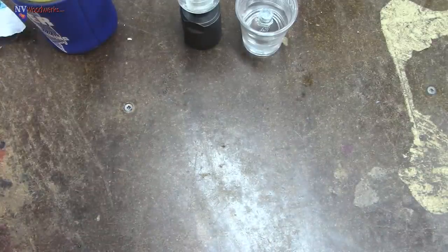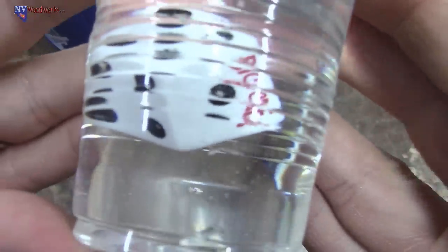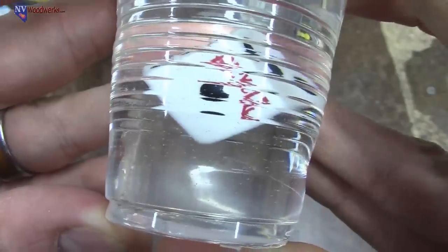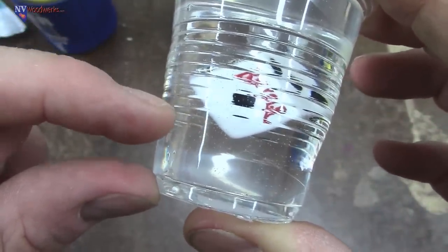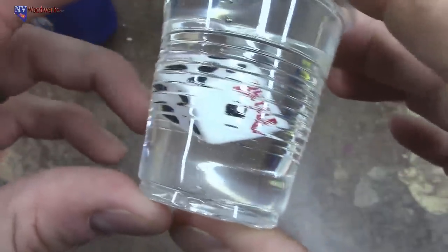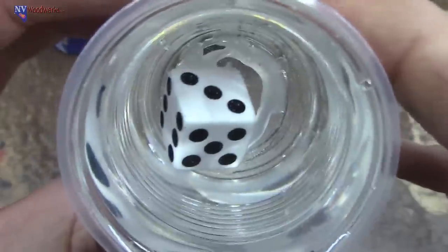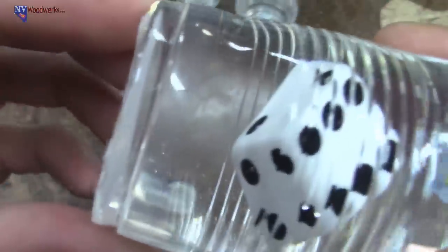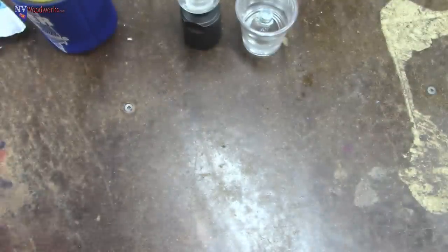Now this compares to the one that we did. I had to scrap the bolt, it just didn't work. But this one actually has bubbles. Part of the reason might have been because I waited a little too long to pour in the first layer. I mixed it up before the show, and it was probably a little longer than I would have waited normally. But still, this is why I use pressure for everything, because I don't want little bubbles in my blanks. Pressure is the easiest way to ensure that you don't get that.